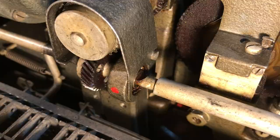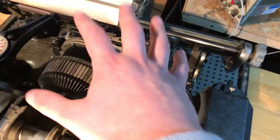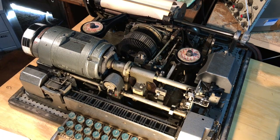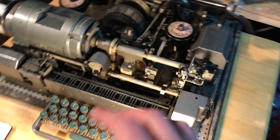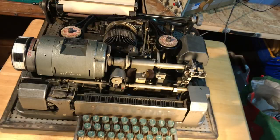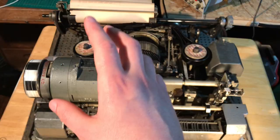The main modular parts are the carriage assembly, the solenoid under this cover, print head assembly, motor drive, and the keyboard unit — they all just come off quite easily with a couple of screws. You've got to think of two main parts of this machine: there's a transmit part and there's a receive part. Like a normal typewriter you'd expect to type and it would print, but that's not how it works. This is what's received, and you transmit your message from here to another teleprinter. The motors on those two teleprinters are synced up, and that's why you have this striping on the speed governor case — you put a stroboscope on that to measure the speed of the motor.